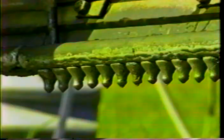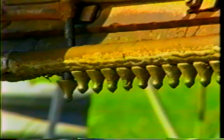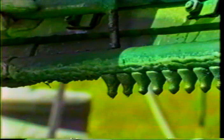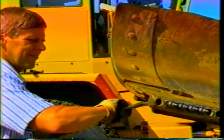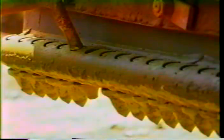When the first new set of teeth has been installed into the grader, they are used for approximately half of their service life and then replaced with a new set of teeth. The half-used teeth can then serve as spare parts. The teeth are removed using a spike and a hammer, or by a dedicated device. A tooth that has broken or come off during operation should be replaced immediately with a tooth of the same type and condition.